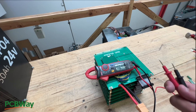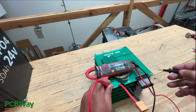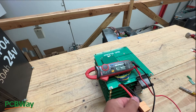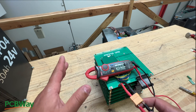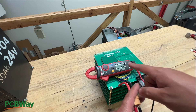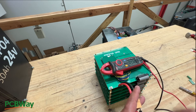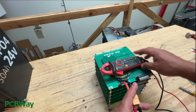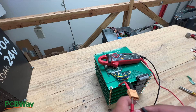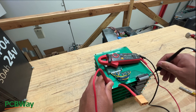With the multimeter, if you check here, you're going to see — 43 volts? Look at that. The battery is at 44 volts, but the output of the BMS is at 43. The reason for that is just leakage — tiny amounts of voltage that get past the MOSFET switches. That is an indication that the BMS is off, because it's not the same voltage. But then when you connect that in there, now it goes up to 44. That matching voltage is an indication that the BMS is on — 44.3, 44.2, and on the actual battery terminals, 44.2. Now the voltage matches.